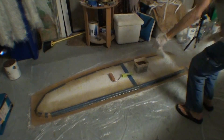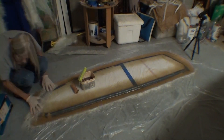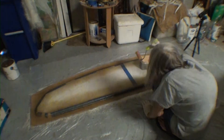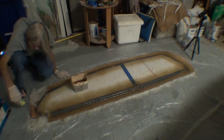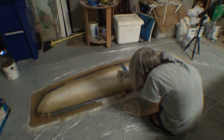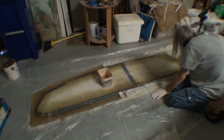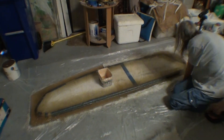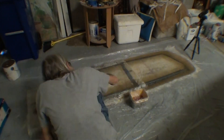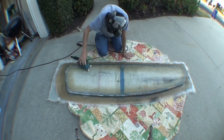Now that this is smushed flat, I'm going around and laying a whole bunch more layers of that really thin chopped strand mat, because since it's so thin, you need more layers to build up the thickness for strength. But it really does conform to compound curves beautifully. I'm using some bigger pieces of fiberglass to fill in the center area rather than having it open there, just to make the part stronger so it's less likely to break while it's being demolded.